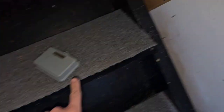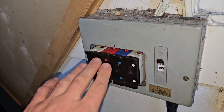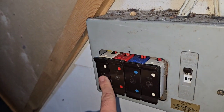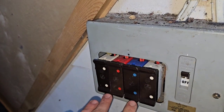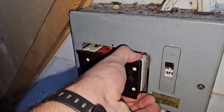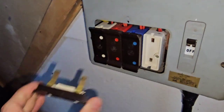When we get that off and out of the way — there was a giant spider, like Shelob protecting that thing, so I don't know where it went and I'm a little bit worried — anyway, these are our fuses. As you can see they're different colors: we've got 5, 15, and 30 amp. There is a significance with these which I think is quite a clever design. Let me withdraw these so you can see the blades — this is our 5 amp.